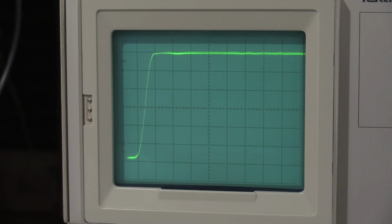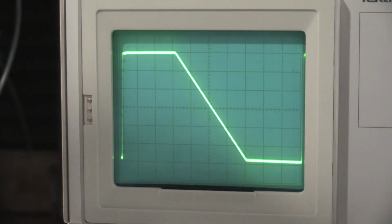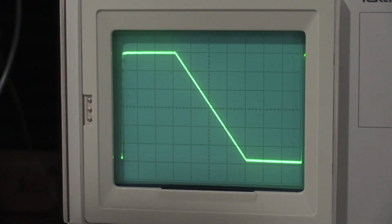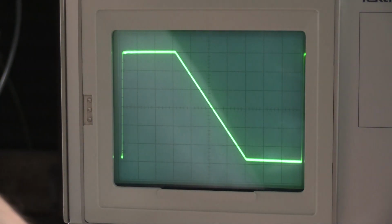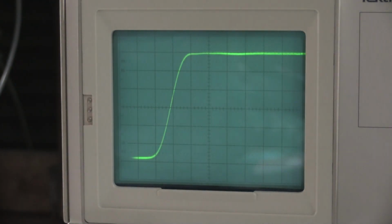So this is the waveform I looked at. On the trailing edge, I didn't need anything, so I have a real slow trailing edge but a real high pulse time just to not stress out the function generator. But 5 nanoseconds is as fast as it goes. Let's take a look at a 1 nanosecond and see what it looks like on the high-speed gear.